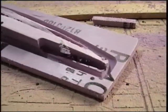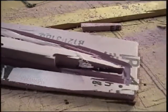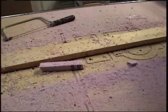Like I said, I didn't take a real hard look at the toolpath before I ran it in foam. I was mostly checking out the density for the surface finish. You can see here, I was doing about a 1/100 of an inch step over in the depth, trying to get a nice, relatively smooth finish, which is okay.